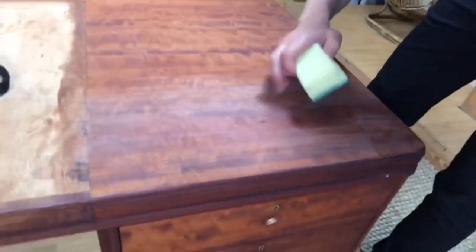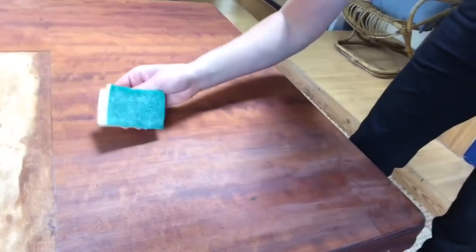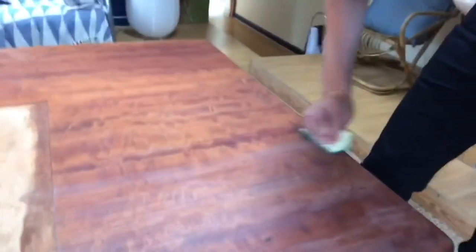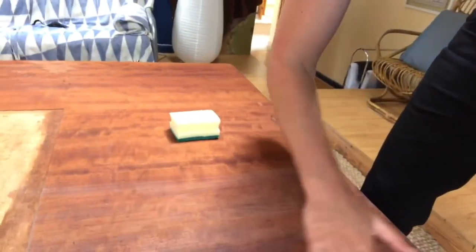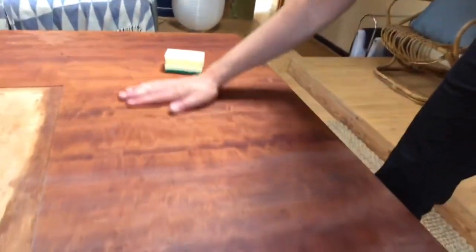When you put the oil in and sand the oil into the wood, it raises the grain, and when you touch it, it feels rough. But as you can see in this area, it looks a bit lighter. I'm just rubbing it down with this Scotch brush. It gives it an almost white glaze. But then that's smooth. Listen to the difference.